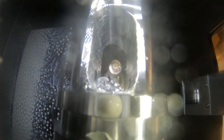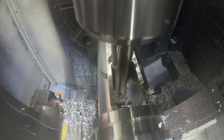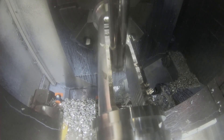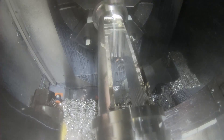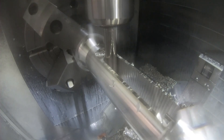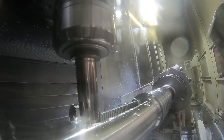Here's a shot I tried to get from underneath so you can see the cuts the plunge mill is taking — it's kind of hard to get the lighting right for that shot. It's stepping over roughly about 3/16 of an inch per pass, or per plunged hole. If this works and is consistent, it'll be a lot faster than roughing with an end mill from the side. In this video I don't have the finished cuts of this slot or any of the details down at this end of the part — I kind of ran out of time.